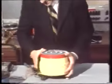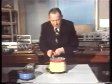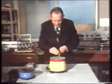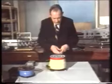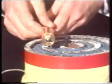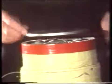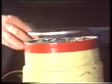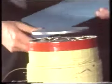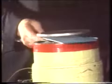So when we put both coils on together, we can perhaps detect with the copper cylinder a very slight tendency to produce inward travelling fields. That is the bottom of the cylinder moving towards the centre. That's what we're looking for. Now, magnetic field takes no notice of pieces of wood or cardboard or paper, so I can pass a piece of wood underneath without affecting the floating disc in any way.